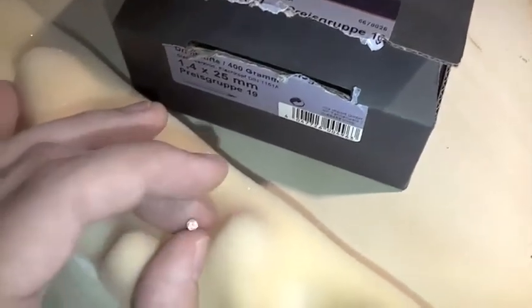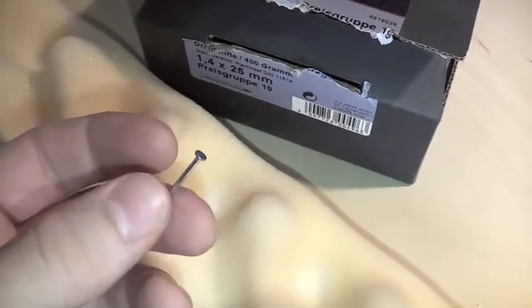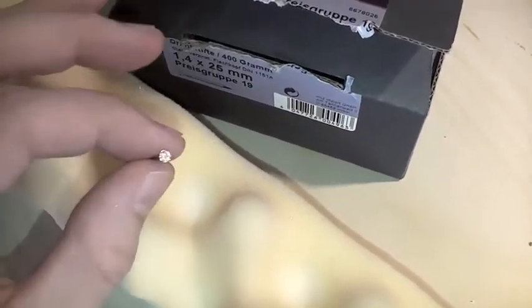So I've seen this in studios actually, where you have some rusty parts in the wall and the rust just gets soaked up like a sponge. Well, this basically is a sponge, and you're gonna have brown rings around every nail, or everything that is metal. And it doesn't only look horrible, it looks really horrible. Like, it looks like those were up for 20 years, and you don't want that. Those nails aren't too expensive compared to the regular ones, so you want to have those. You don't want rust.